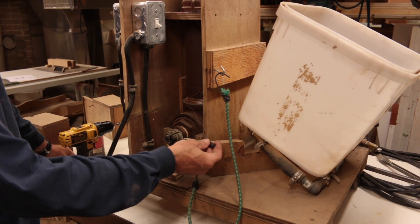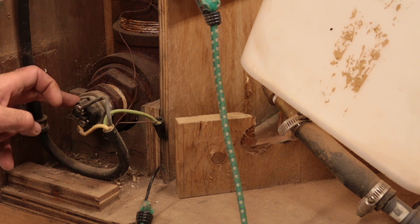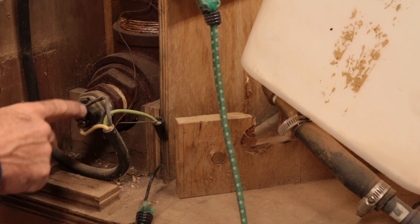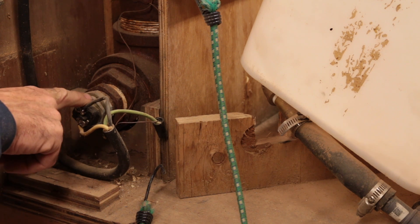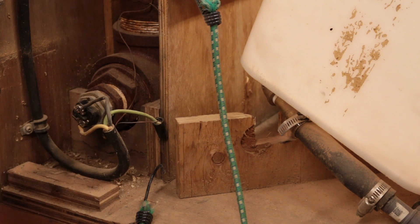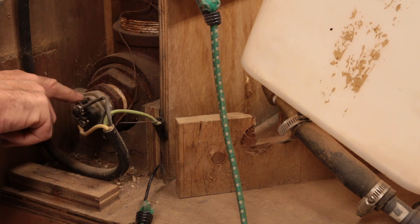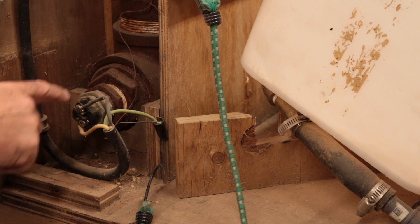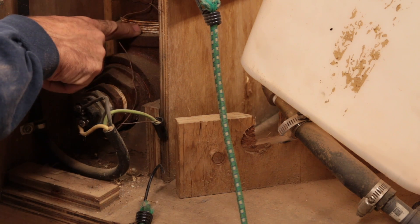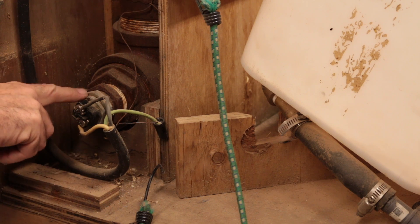This side is really the same thing. I had to go down through three different bushings until I got to one sized to fit this coil. Now, if you talk to a guy at a plumbing store and tell him you want a bushing to fit a hot water heater coil, they'll tell you to get lost — the hot water heater coil is a different thread than national pipe threads. But I've found they are close enough that the rubber washer on the coil will compress and seal it up tightly. We're relying on the rubber washer, not the threads, for the watertight seal. And don't forget to wrap Teflon tape around the pipe threads, or use pipe dope.